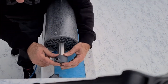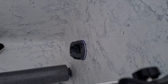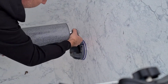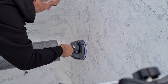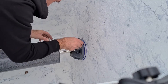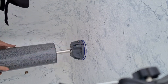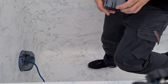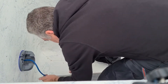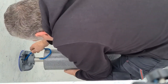Installing the tube between the mounting pieces — now we show you the unique advantages of the ball joint system. The ball joint adapts easily in length by sliding the stainless steel part in and out of the tube. The placeholder can only be clicked in one way to ensure strength and avoid installation errors. Thanks to the round end of the ball joint, the tube can be moved in all directions, taking care of tolerances during build and making it easy to place the tube one end at a time. A true one-man installation.